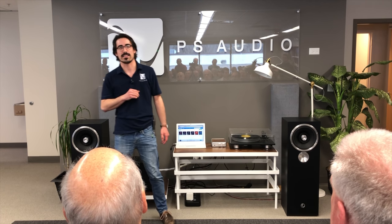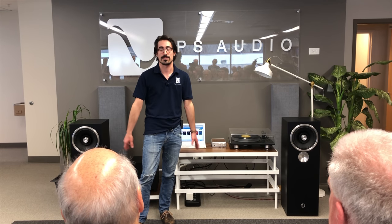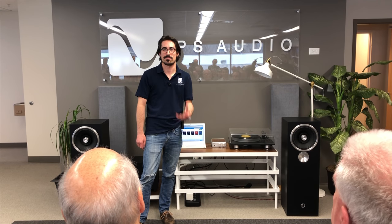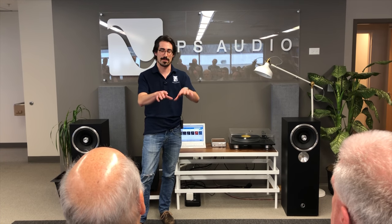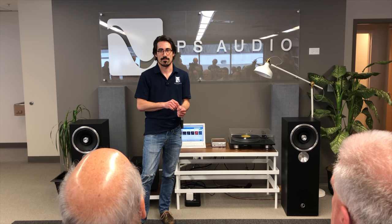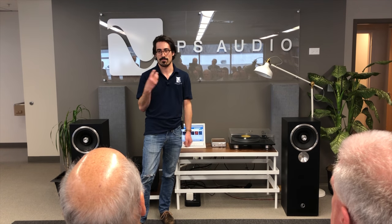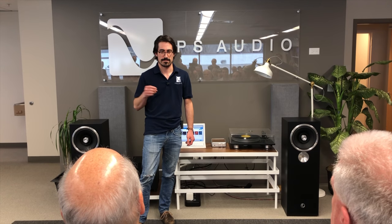Anyways, I went in there, and I had this feeling that the one note thing wasn't there for me. I was comparing it to a few other phono stages, and it was better than them, but something told me to start really hunting and making the big changes. Don't worry about the small stuff yet. And so I decided to try the different RIAA compensation. Again, you have three big ones: passive, hybrid, and active.